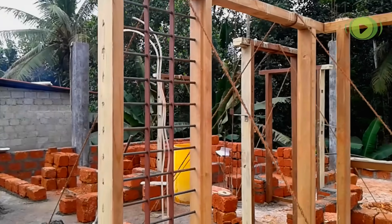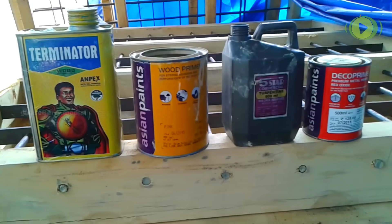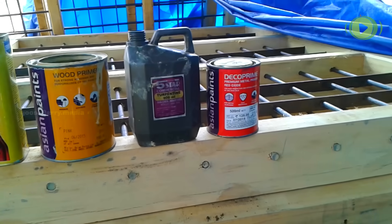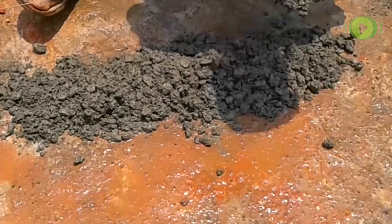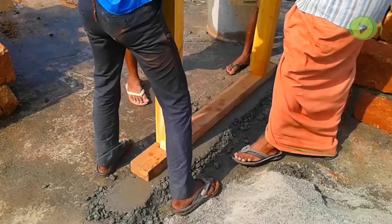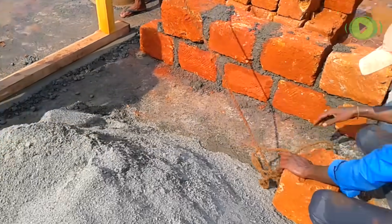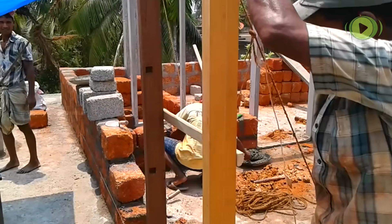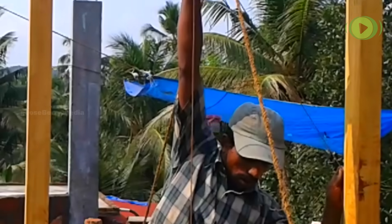Frames of doors, windows, and ventilation can be of different materials like wood, concrete, or steel. For wood frames, termite-proof material and wood primer are applied; for steel window frames, metal primer is applied. The place of activity is cleaned and made wet. The position where the door frame is to come is marked, the door frame is placed, and a rope is laid through the upper end of the frame to both sides and connected to a block.